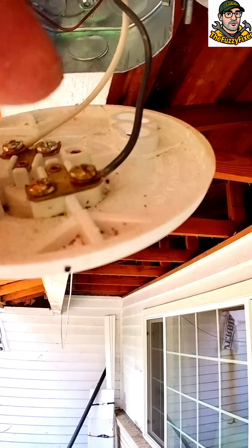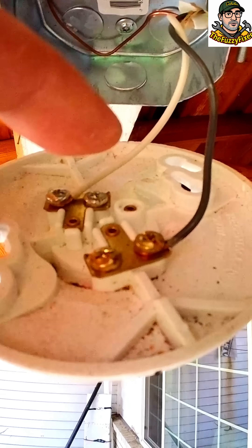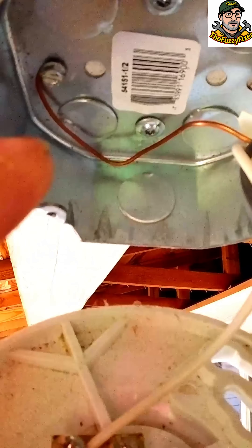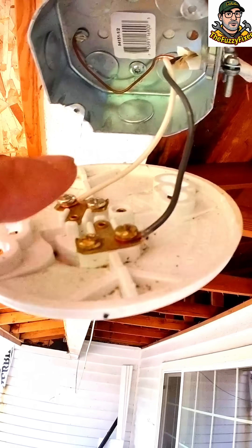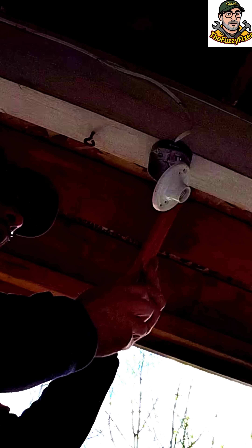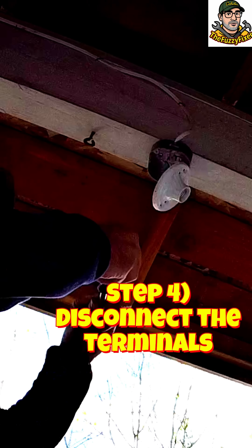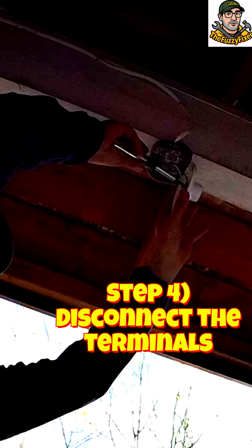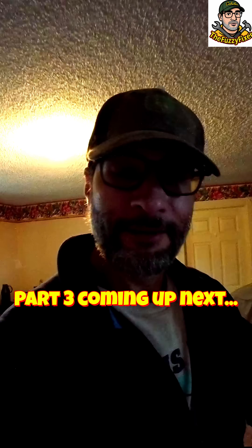What we're going to do is disconnect both those wires and cap them off with a wire nut. The positive power side is always going to be either red or black. Neutral is almost always going to be white. Ground is going to be green or bare copper — it doesn't have to carry much load, it's essentially a safety overload protection. We'll use a hand screwdriver — no need for a power driver here. Let's go ahead and disconnect the hot wire first.